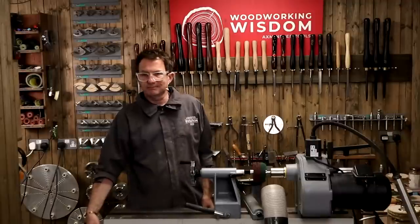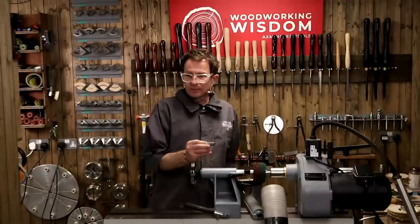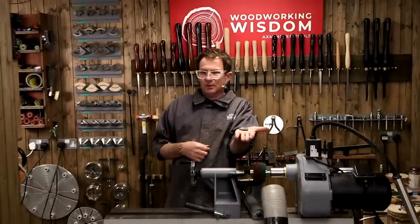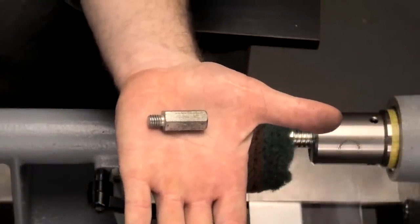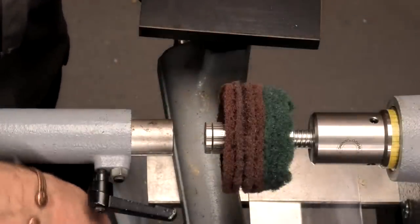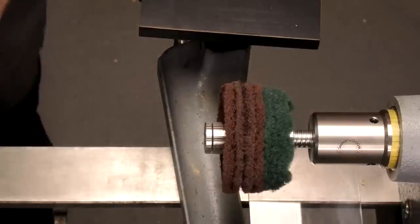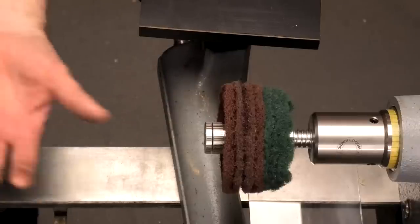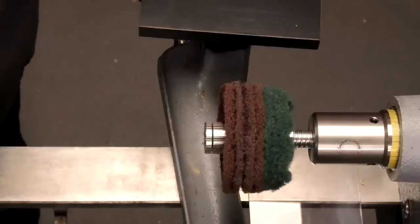There's this thing, okay? Which is the nut. So that's the nut that stops you pulling the tailstock off the end of the lathe. To give you somewhere so you keep it safe, you can screw it into that hole. So when you take it off the bed, you screw it into there, then you lift your tailstock up, and then you know where it is. You haven't dropped it in the shavings and thrown it out the door when you shovel up, okay? That's the only thing we can figure out is useful, all right?